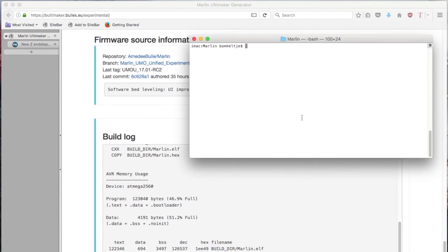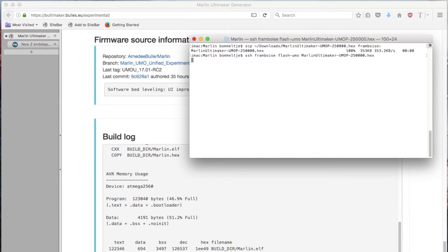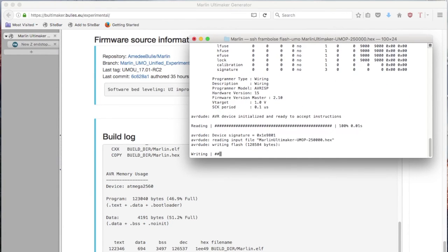Typically you will use Cura to flash the firmware. I normally never connect a computer to my printer, but I have an OctoPi Raspberry Pi server running, so I'm just copying the firmware onto the Raspberry Pi and flashing it from the command line. The flash is running.